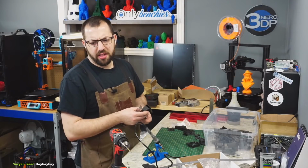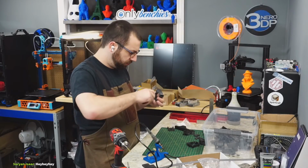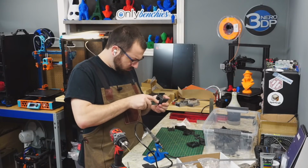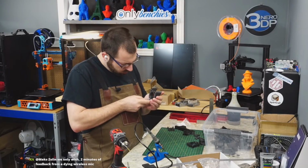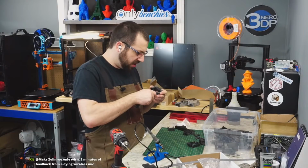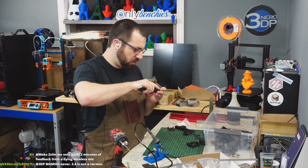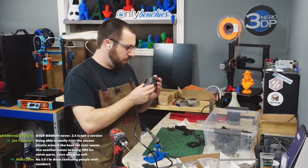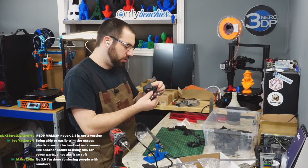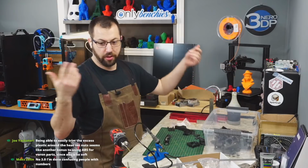Want to reduce weight on the X-axis, or are carbon fiber tubes instead of aluminum extrusion possible? You'll save more weight going to a single X-rail. And in my opinion, chasing grams isn't honestly worth it anymore with Klipper and proper motion pathing and input shaper and whatnot. We're having people print sub 10-minute Benchies slinging around a full Afterburner tool head with the direct feed NEMA 17 pancake with dual X rails and whatnot. No problem, so.